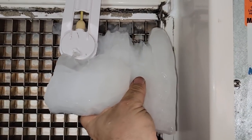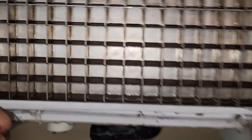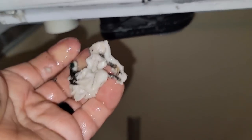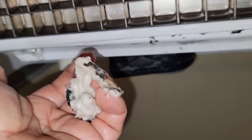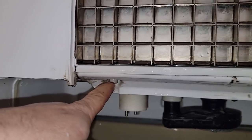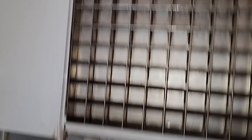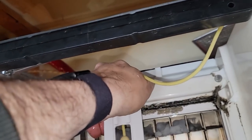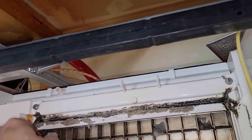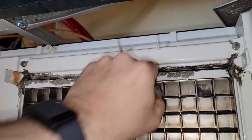You gotta be really careful here — I'll give it a little bit of a thumping on the side, but you could break that. When you're cleaning these out you've got to get this thing out of here. That's some really nasty nasty crap. You've got to take this 3/8 nut off here, drop that down, take this thing completely out, get back behind there with your sprayer and clean all that crud out.